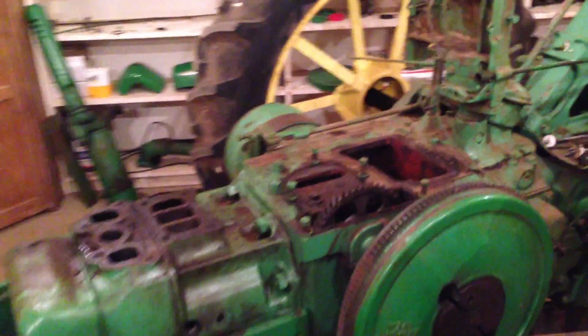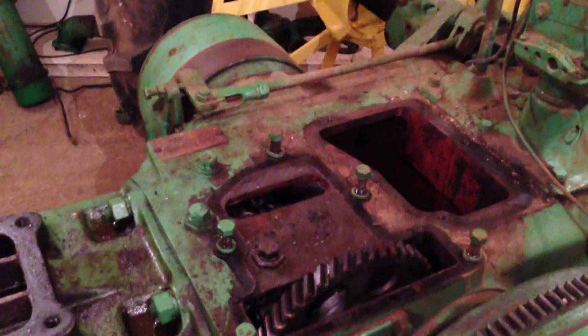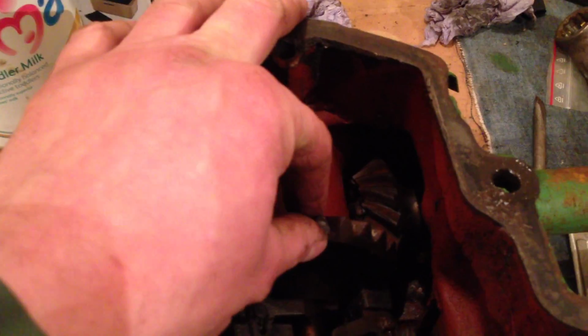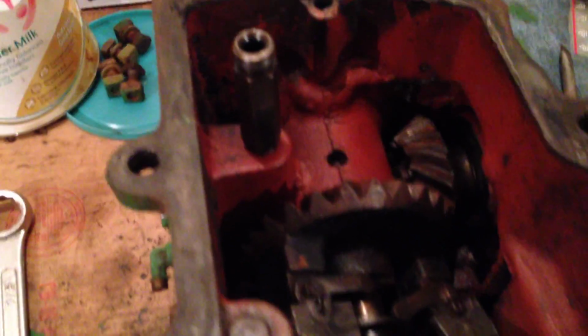There's a lot of things that suggest it hasn't run for a long time. Some gears have got rust on them. The governor over here is extremely dry inside the housing, which suggests to me that it's not been run much recently. A lot of play. The heel's gone on the back of the two bevel gears, so that needs adjustment. The backlash, as I thought, is non-existent, and in fact those two gears are just about serviceable. We'll know better once I try to shim it all back up.